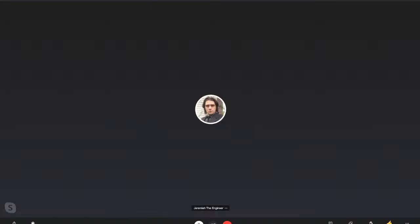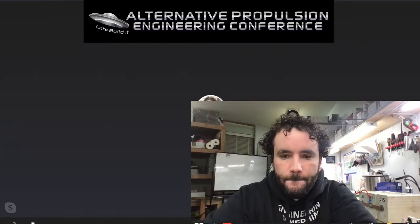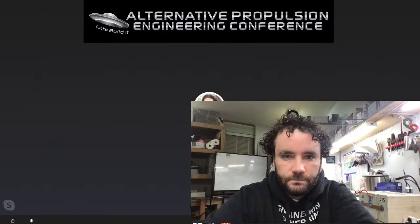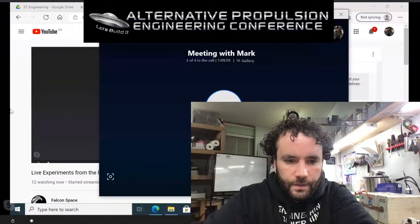And this is a component for which experiment? This is a system that we can use for multiple experiments, including what you're doing tonight, interestingly. Of course, you're kind of on your own with what you've got to set up tonight because you don't have this thing sitting there, but we'll be able to use it for the same type of purpose. And we'll use the SCR version, too, to pulse that electromagnetic coil so that we can have a non-continuous field. And if we do get Larmor precession in that piece of aluminum by proxy of the magnetic flux and the rotation, then the pulsing circuit, whether it be solid state or mechanical rotary gap, will still allow us to have a changing field almost continuously. So it's multi-purpose. It's just a piece of technology that we're going to use for various experiments.